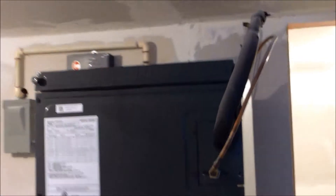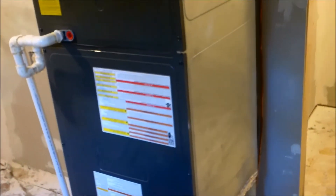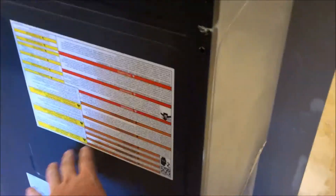The finished product is the Goodman 2.5-ton and it is installed and working beautifully. For trailers you traditionally have to have a downdraft unit. What they do is take the evaporator — kind of like a radiator — and move it to the top, then move the fan so the fan is sucking through the filter with the filter up top now. That changes everything up, and the HVAC guy told me it works, and it is working.